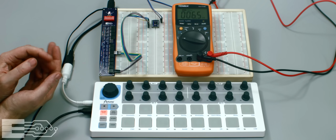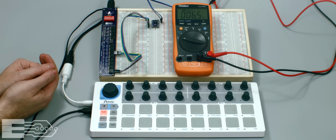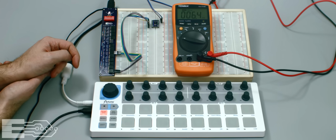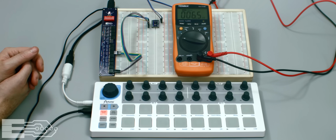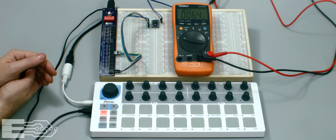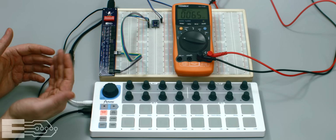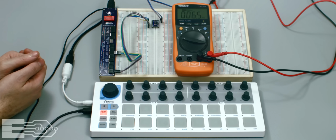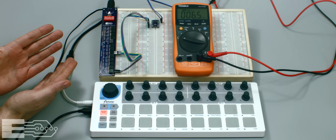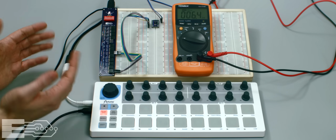Voila. So we swapped out the Shift Me for the analog shift module, and it is wired up the same way. The clock, latch, and data off of the MIDI control port is wired over to the clock, latch, and data on the analog shift. Now the analog shift is a smart module. It has a microcontroller on board. It accepts the 7 bits that we showed you on the Shift Me, but instead of turning a bunch of lights on and off with it, it's actually taking whichever voltage you're providing to power the module and dividing it into a linear 128 steps.